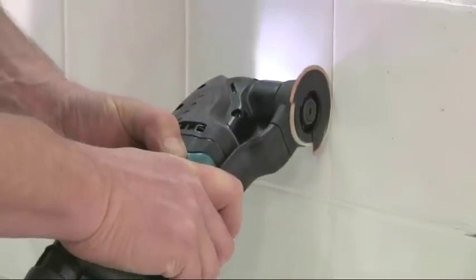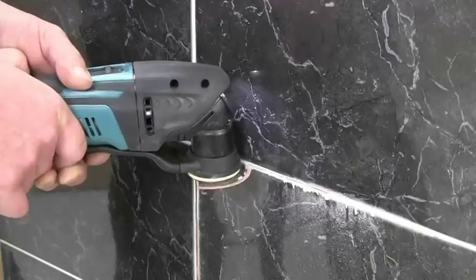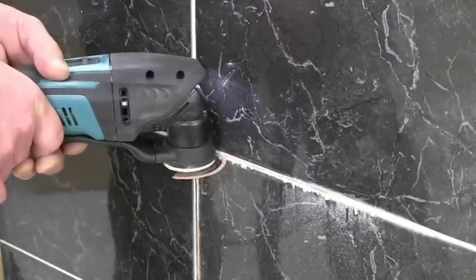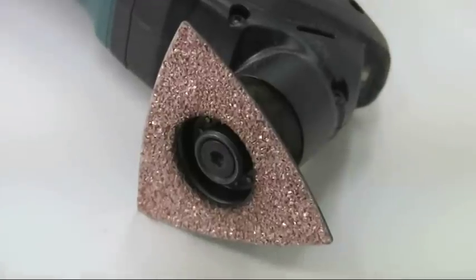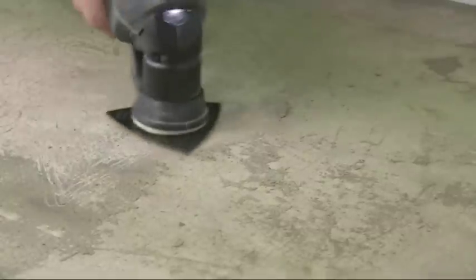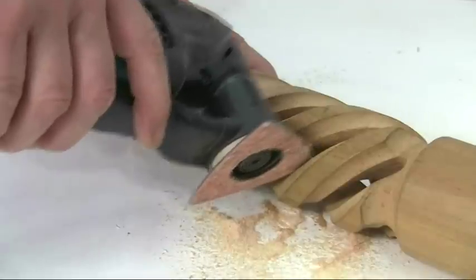There are also some useful blades for work with ceramic tiles. The B21509 allows you to remove narrow grout lines between tiles, for instance when you are replacing a tile. You can also use it for cutting holes in fibreglass and epoxy. The B21515 is more of a rasp, and this will remove accumulations of tile adhesive, cement, and carpet adhesive. You can also use it for shaping wood.